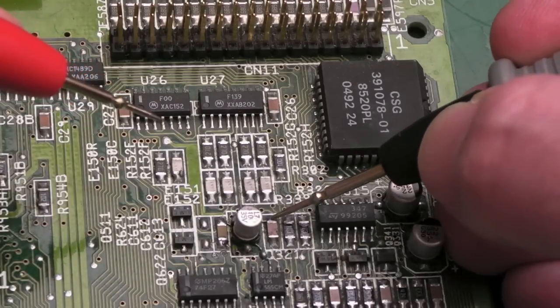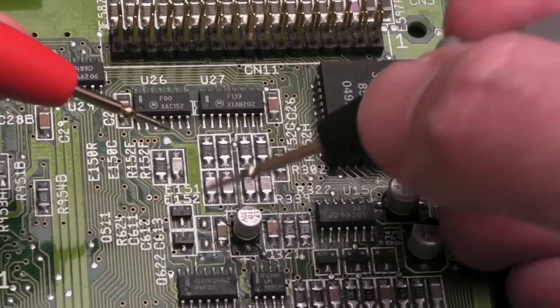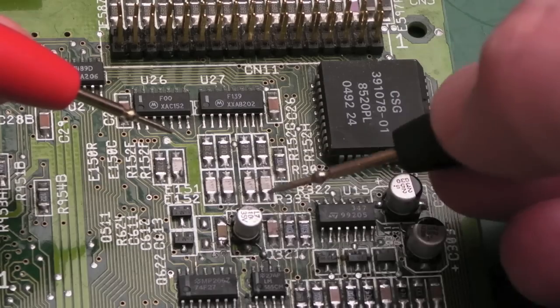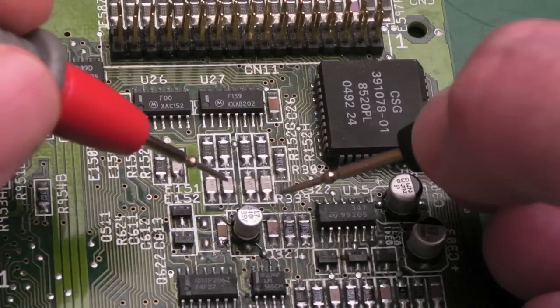Now it looks like the way it's wired, it's going kind of under. And because it's going under, it's very easy for a wire like that to short onto either the positive or the negative of the underside of a surface mount cap, because there's only a little gap in between the two. It's very easy for wires to short onto that.